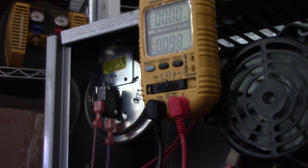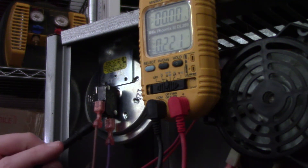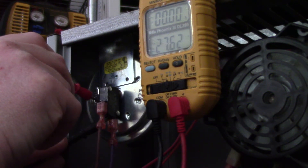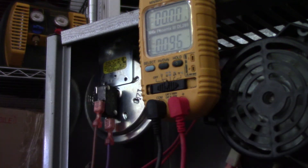As mentioned in another video, this is a 24-volt safety. How do we know it's 24 volts? We'll put a probe on the tab here — the meter says 27, which is a little high, but it's normal. Because you have a relay for the blower or the inducer motor, relay for the gas valve, relay for the blower motor. By the time everything gets activated or energized, it's going to drop down to 24 volts. Back in the old days there wasn't as much stuff, so it would be 24 volts.